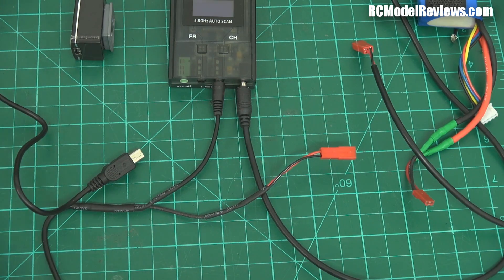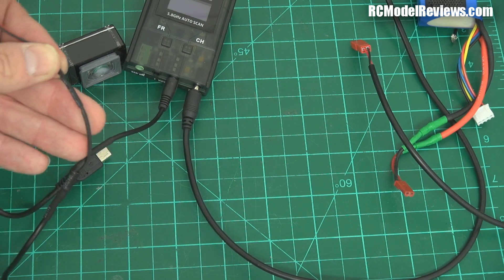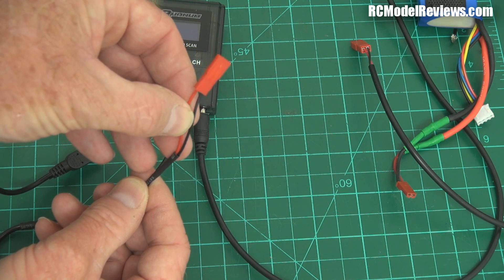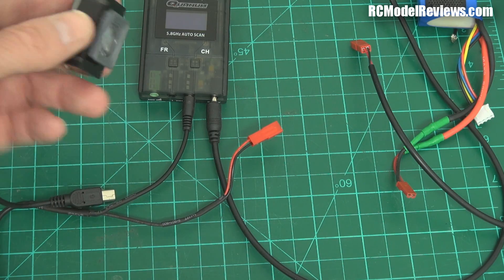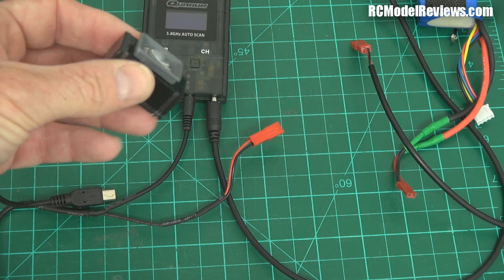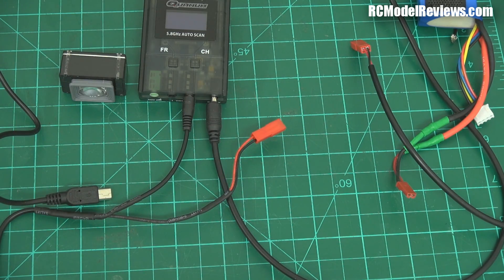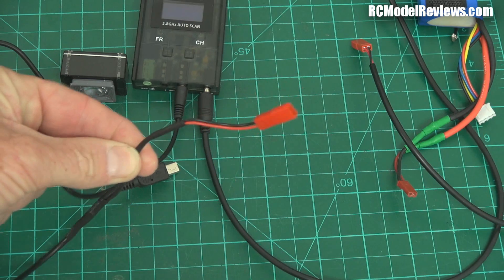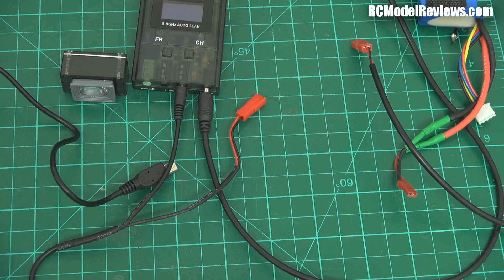This is part one of the video. I'm going to have to go away now and strip this down and have a look. This has turned into a really interesting video because I've shown you - never assume anything. There's a splice in the wire here - have they spliced it such that the wire colours may be incorrect? I have to check all this before I can test it, or I'm just asking for a little fire on my bench and 60 bucks down the drain. Banggood sent this to me for review. Beware - you could be buying some Chinese fireworks. Stay tuned, part two will be coming up very shortly.